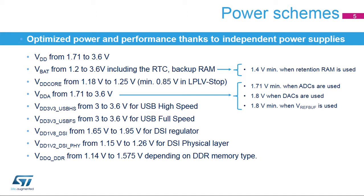When comparing stop modes, stop mode power consumption is higher than LP stop and LPLV stop, but the wake-up time is shorter. For stop and LP stop modes, the number of active wake-up peripherals is higher. Stop and LP stop modes keep the V-core domain at the same supply level as run mode, allowing a very short wake-up time at the expense of higher consumption than LPLV stop mode. LP stop mode allows the external power supply unit to be placed in low power mode, reducing overall system power consumption. LPLV stop mode also places the external PSU in low power mode and supplies a lower VDD core level, further reducing the STM32MP1 and overall system power consumption. Stop and LP stop modes support the same number of active wake-up peripherals, while LPLV stop mode supports a reduced subset.